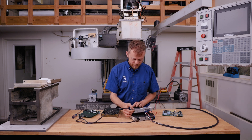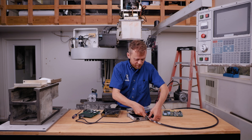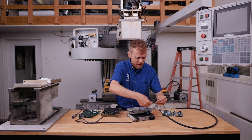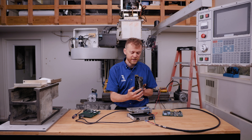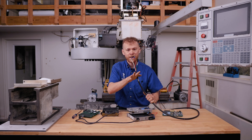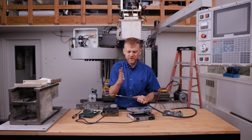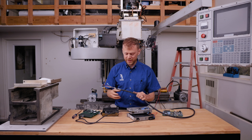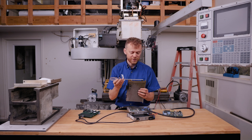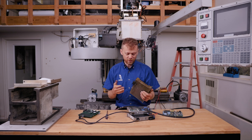Same thing with the motor wires. You have a cable for your X, Z, or Y — there's only three wires that have to do with the servo motor and a ground. You can leave the ground where it is and move the wires over. You don't have to physically move the amplifier. Sometimes the cable is pinched in a ground clamp and you have to pull the cable off, or like if you have a sub-spindle machine with all these amplifiers, the cables are just not going to reach. In that case, you do have to pull the amplifier. You need a long Phillips screwdriver to get to these plugs, and you can pull them out and swap location or swap a new one in.